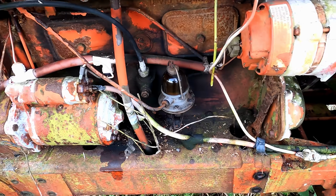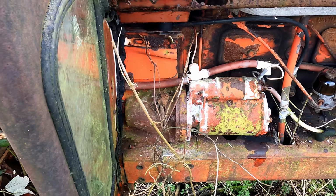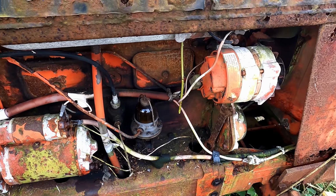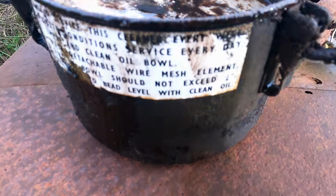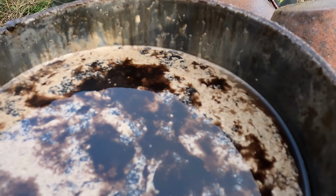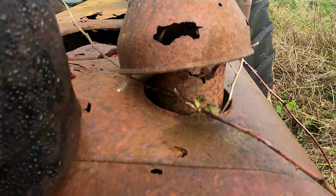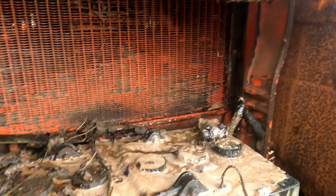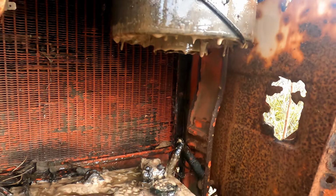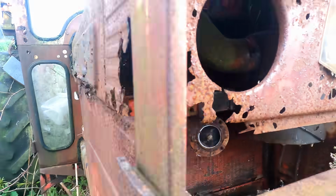I have brought an extra battery lead and isolator switch, so we'll remove the battery and connect that in. This is why you always pull the air intake and check it. Look at that. The pre-cleaner had rusted away, filled the oil bath filter with water, and see it there dripping down into the old battery. So we're gonna have to clean that up before we put a new battery in there. And we'll just disconnect that inlet pipe, leave it hang free.